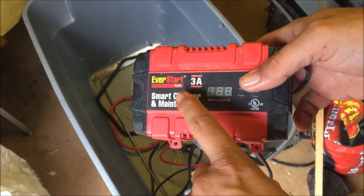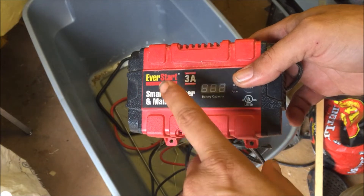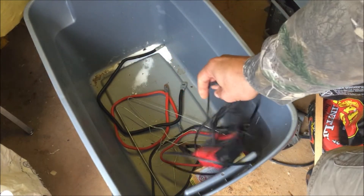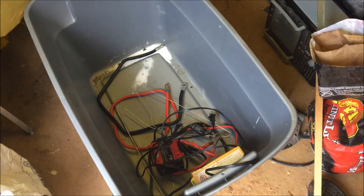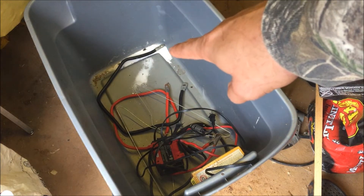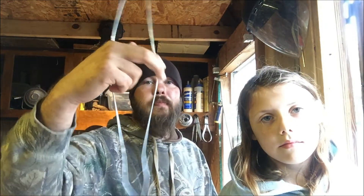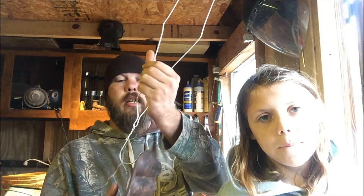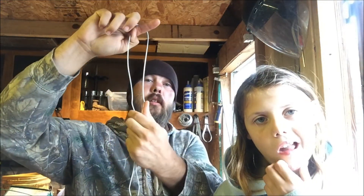The battery charger is why I have to use a battery inside — this isn't a manual charger, it's a smart charger. But with the battery we'll be able to work around it: we charge the battery, the battery sends voltage to the e-tank. We're going to take our coat hangers and bend them so that we can hang our cast iron from the bar as it's submerged in the tank, and then you're going to hook your negative battery cable to the wire for the piece you want to clean.